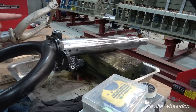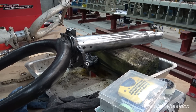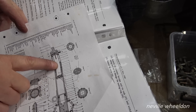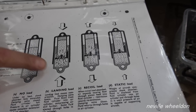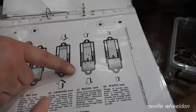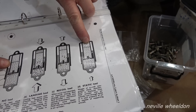Inside the leg there's another piston — that's the outer piston, that's the end of the piston, and that's where the dampers and hydraulics are. The hydraulics will be on this side, and they also come through a little bit, and then the gas goes on top of it. So you've got oil and gas. When weight is off, as it lands, it pushes the oil up through the damper valve, which gives you your shock load and compresses the gas — because you can't compress oil. Then it goes back the other way on recoil.